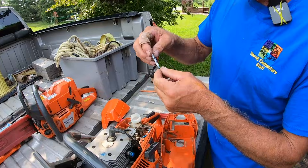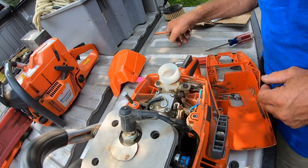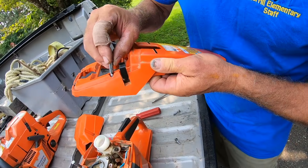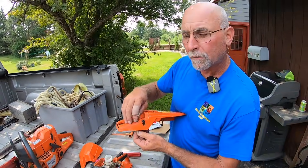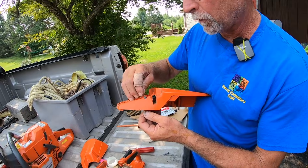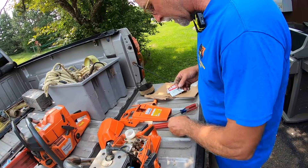So what I came up with — I made these studs and I got a collar on them so the nut is only gonna be on the very top. These are gonna sit in here like this. We gotta get it all squared up, put the cover on, and I'm gonna JB weld them in. They'll stick out just enough because there's not a lot of pressure on these bolts. This is my repair job — I don't know how it's gonna go, this might fail. But I couldn't come up with anything else because you cannot get a nut driver down in this hole.